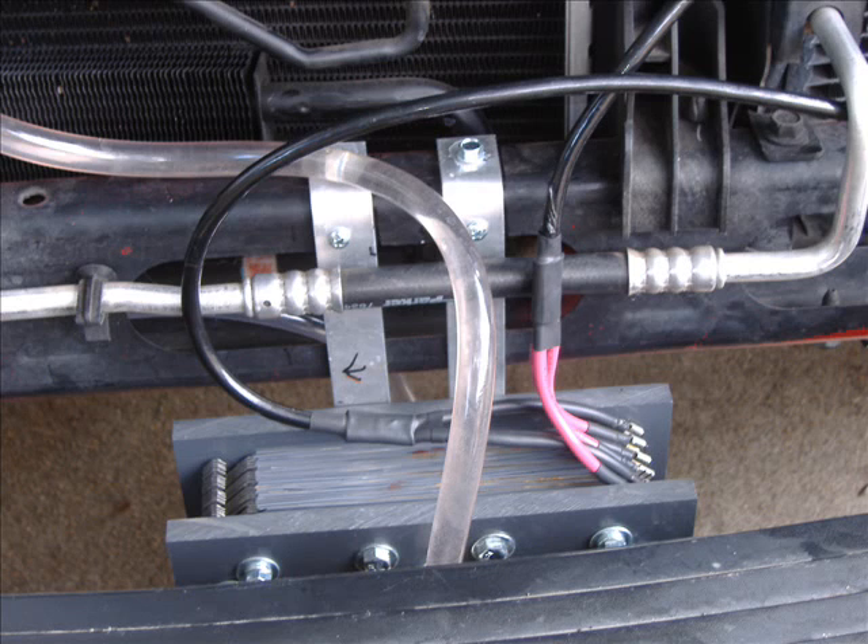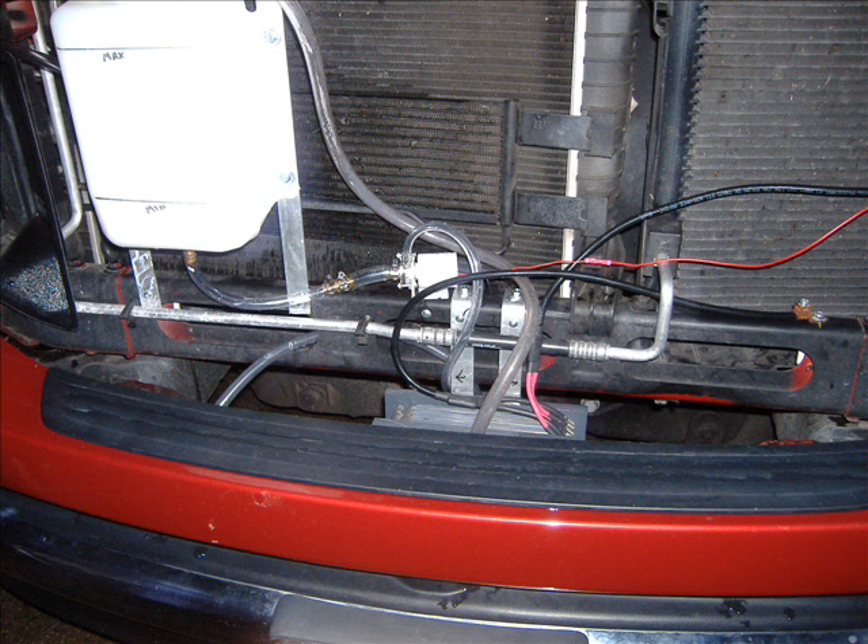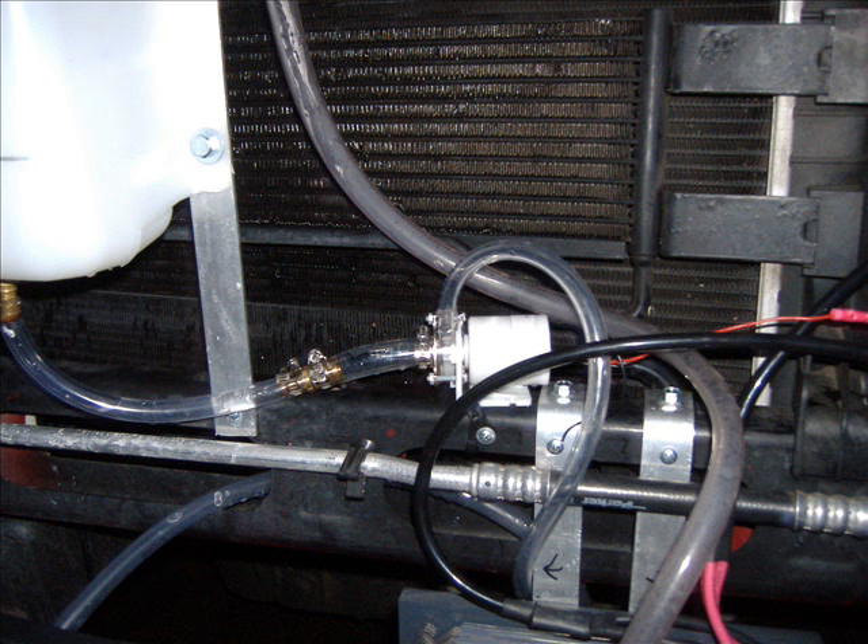I've decided to go ahead and beef up my wiring. I've upped my feeder wires to six-gauge feeders with four-gauge wires feeding them, going back to my ground spot and to my relay. In addition to that, I've installed a pump to help feed the electrolytes and circulate them into my cell. It's starting to get dark, so I'm not going to fire it up for video today, but check back with me tomorrow. Have a good day.